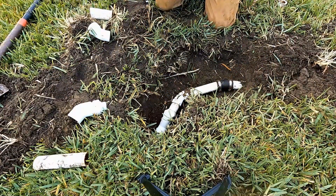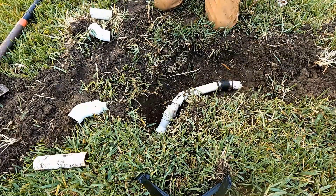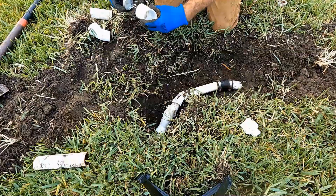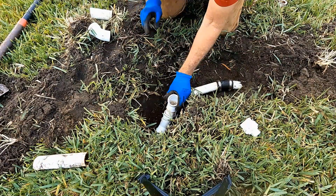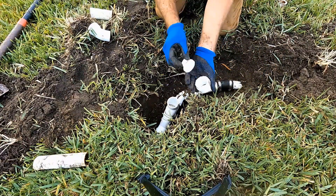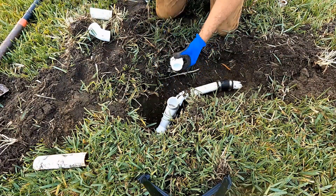Let's put the cleanout assembly together and glue it up. Here's all the pieces — we're just putting a couple of couplings on here, and we're going to put a 45 on here. This is a cleanout assembly: it's got the threaded male-to-female — it's called a cleanout — and it's got a slip coupling so it slides right inside that 45.